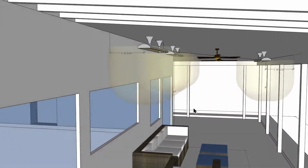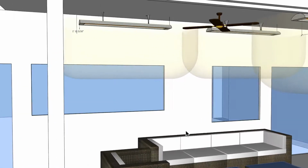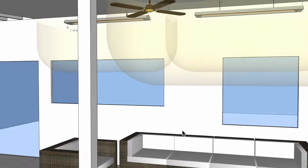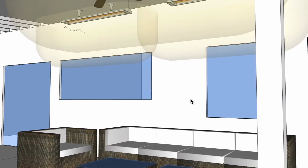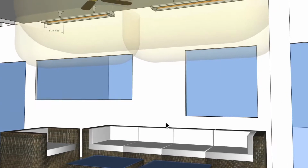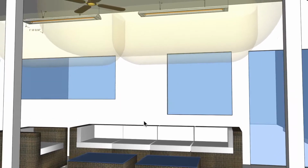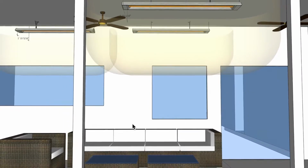Now, the client also did mention that they have a 240 outlet over here. I cannot answer the question in reference to will that power a system like this. I would have to say probably not. You'd want to talk with a local electrician and verify the power that's there and the load that existing power